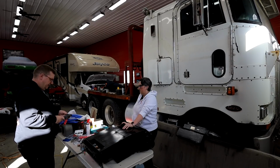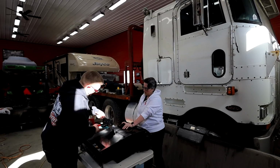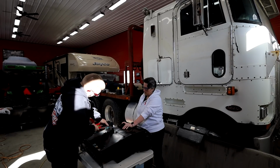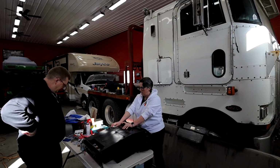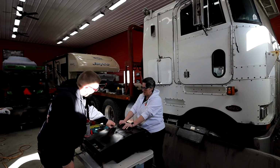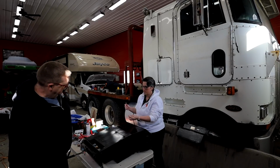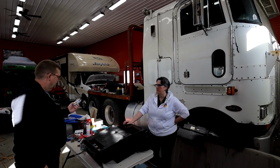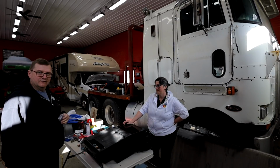If they have a non-Princess Auto brand, just take note of the size. Because the thing that clamps, it broke the top off. But how does it break off there? Well, inside the rivet there'll be a little line, so when you pull hard on it, it's supposed to break inside the rivet once it gets to a certain torque. My fingers sore. All right, stay tuned. Off to town to get some rivets. 3/16 rivets and not Power Fist.